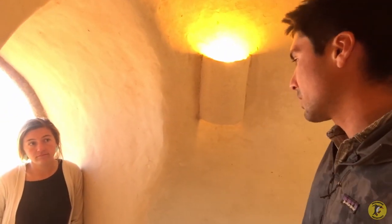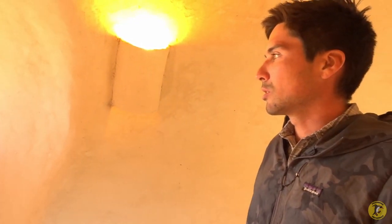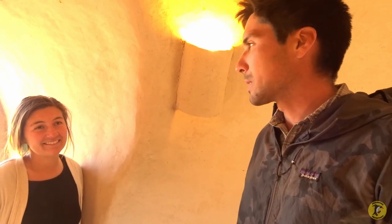It's really cheap to make — we're using native clay, pretty cheap lightweight sand, and some toilet paper to do these plasters. You don't have to go to this level of aesthetic; you can make them simpler. But we want people to be comfortable when they're inside. Most people who stay here say it's small, but in these desert elements it's really nice to retreat to this kind of cavern — escape the wind and the crazy elements that come from the desert.